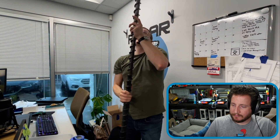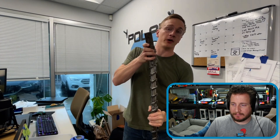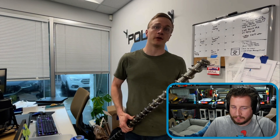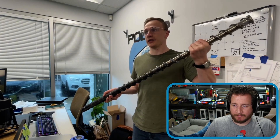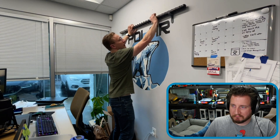If you've ever visited Polar Filament before, you might have seen this screw that I keep above my desk. This is my reminder to not do stupid things while trying to make filament. The screw is a normal old extrusion screw, except that it's completely broken — it weighs about 35 pounds, maybe 40 if you include the other part that snapped off. The story is that one day I was making filament from one material and going to transition to a different material. They were both from the same person and were supposed to have the same melting properties, so I should have been able to transition no problem — but this tells us otherwise. Even the same material can have widely different melting points, and mixing one material with another might create a monstrosity that clogs up your machine. If you do that on a large enough scale, you have this four-foot screw that is just caked in mystery material that can't spin anymore. The motor was strong enough to just snap it right in half. I use this as a reminder to not extrude any mystery materials without first reading the data sheet — and I keep it right here above my desk, with a 3D printed hanger.